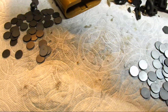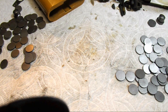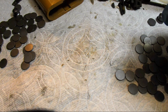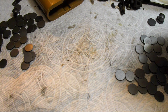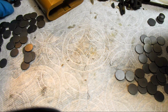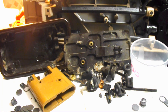So now we have 50 on the left and 52 on the right. We'll just take one from the right to the left and we'll have equal stacks of 51. I have removed as many as four from each side and had normal operation, so going from 52 per side to 51 is not a problem. I polished up the lead carbon connections on both sides, and the end backstop thicker disc — they're all good. I'm going to clean up all the housing parts and then reassemble.